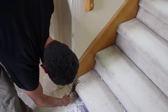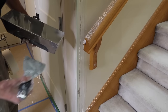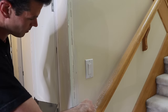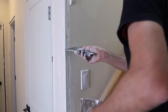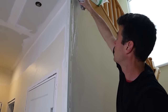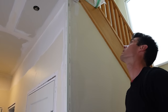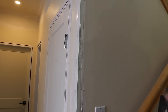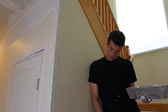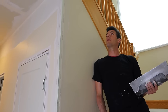I'm going to have to throw this pan of mud in the garbage when I'm done — it's got so much stuff in it. We're looking pretty good there. Even though it doesn't look perfect, it's all under this lip so it'll bury nicely. That's good — I'm happy with that. That's probably a lot of footage, so maybe we'll just call that three corner beads. But that's how I install corner beads most of the time. Most of my jobs are like 20 beads or less so I don't find the need to get the tools out.